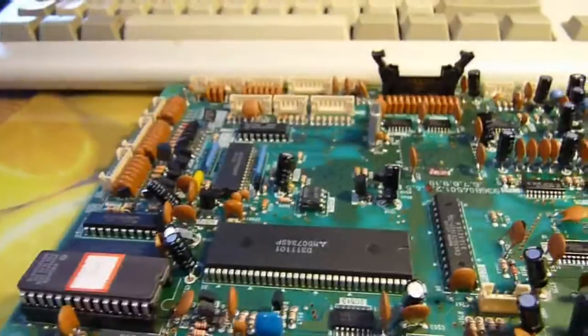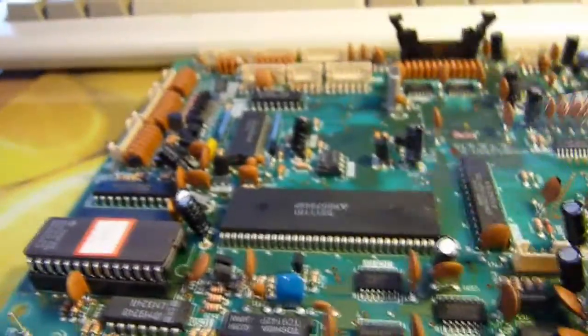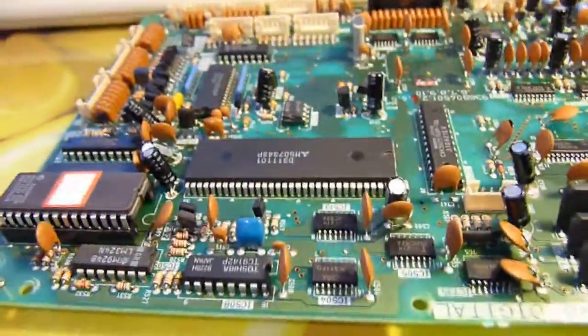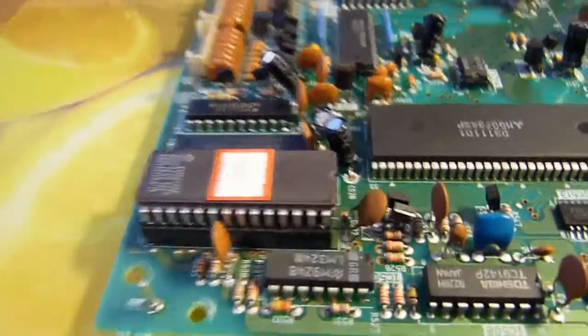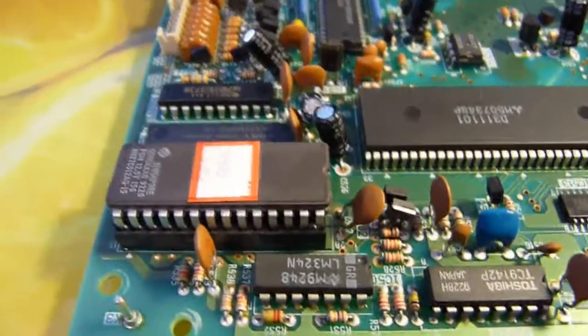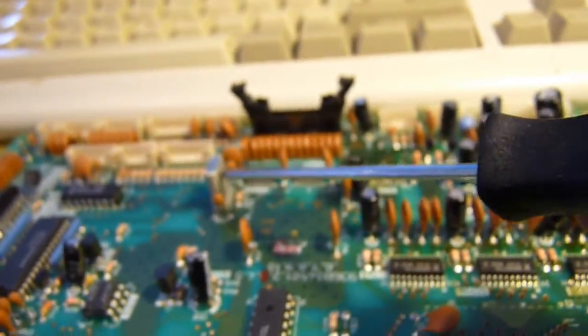Power down sleep mode, well, everything has that. And extended memory addressing. But of course, this is just a beam brain, so it doesn't have much to do. Also, over here we have your good old 27C512 EEPROM. So we've got a 512K EEPROM, that's kilobits, not kilobytes. We have a crystal with heat shrink that looks like it's a 20 megahertz crystal.